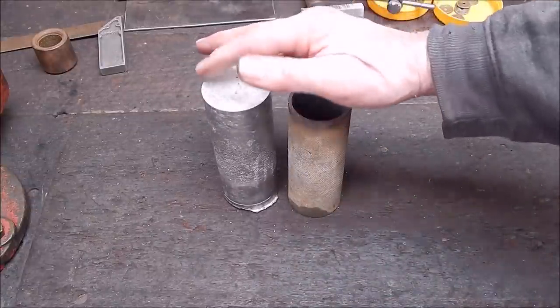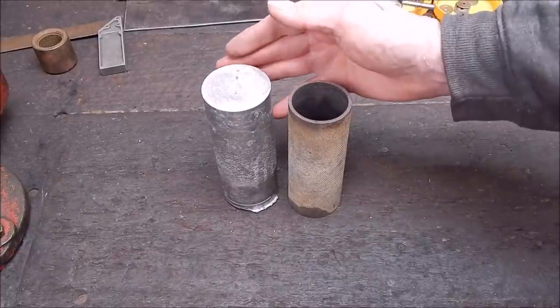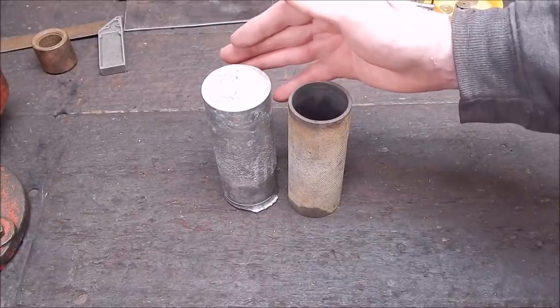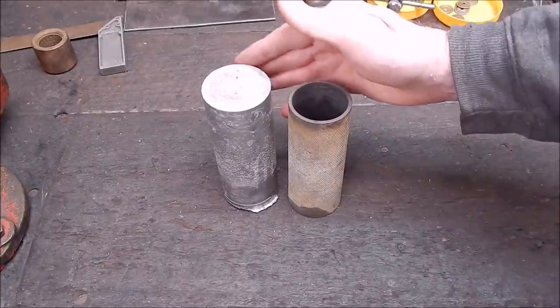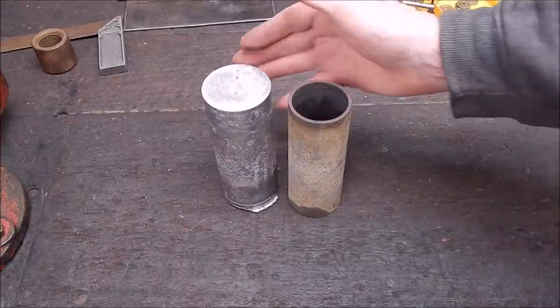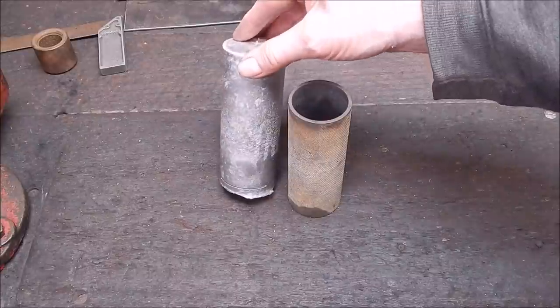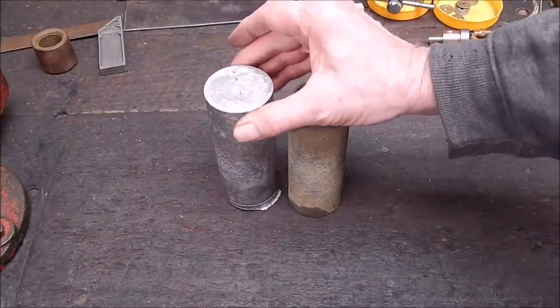And if there's any sort of redness in the slag or the aluminium, you're too hot. You're way, way, way too hot. Nothing should look red hot in the aluminium side. The crucible can be red hot. That doesn't matter. But the aluminium should definitely not look red hot.